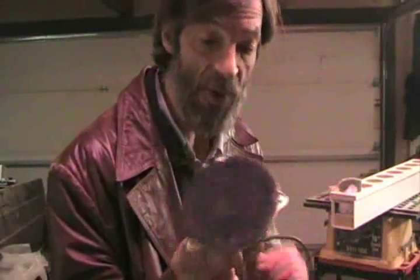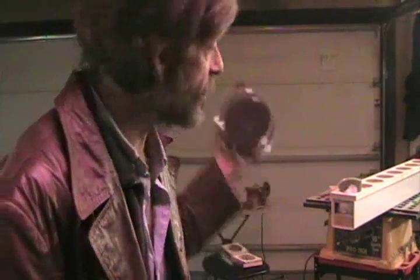So I did use a volt-ohm meter. This guy's 5 inches around, which is why I had to spread my box with an extra piece of wood, which meant extra 32 cuts. If I had any major change, I'd get rid of that extra 32 cuts and buy a slightly smaller speaker. A 4-inch will fit in the 5x5 fence post vinyl pipe. Okay, the vinyl fence post, it will fit without the extra piece of wood. It'll save you a lot of labor. You're going to wear a lot of sawdust on this.